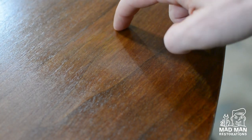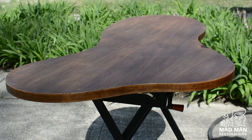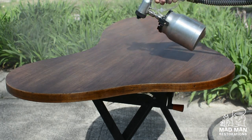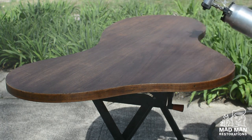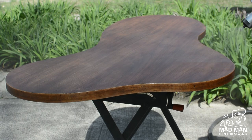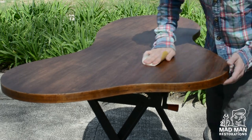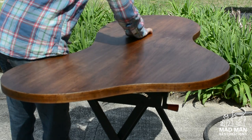This is where I decided to stop in-painting. The goal is to get it as close as possible but it's never going to be perfect — I still have to finish my coloring process with glaze and toner, and this is good enough; after I finish you won't even notice it's there. Now it's time to spray vinyl sealer on the entire piece. Then I wait a couple minutes until it's dry and lightly scuff with 320 grit sandpaper — I do this process two times.